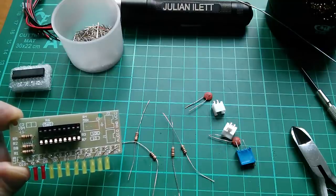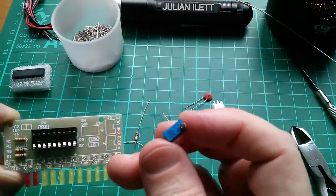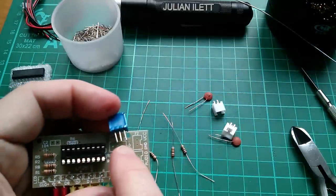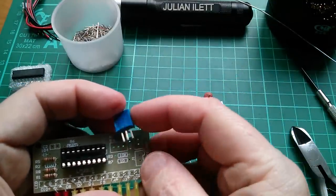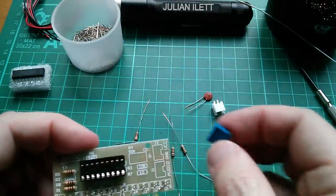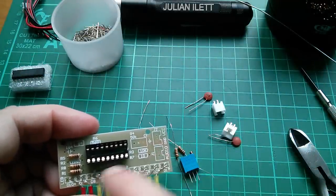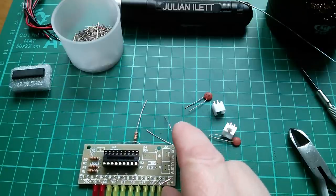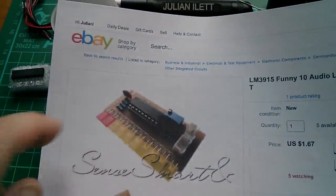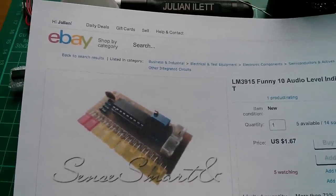The remaining resistors are 100 ohms, 10 ohms, 10k, and a 560 ohm — though they've supplied a 510 ohm, which shouldn't make too much difference. For the pot, the orientation matters because turning it clockwise moves the wiper to one end. If reversed, you reverse that direction. I need it oriented so that clockwise increases the gain. There's an eBay photo showing the adjustment knob near the chip — but I'd rather find the circuit diagram and work it out myself.